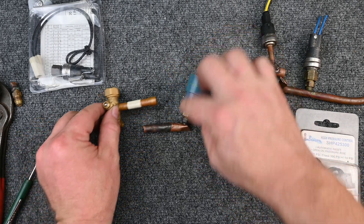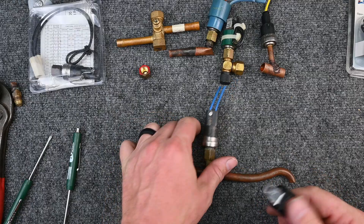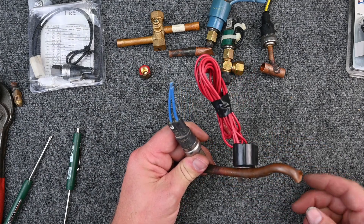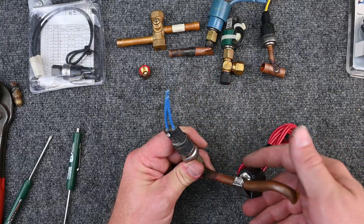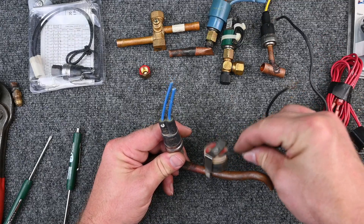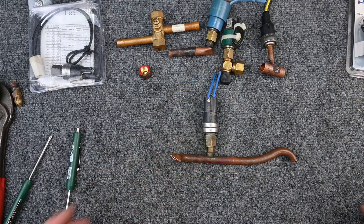Now, these are all a type of pressure switch, but don't confuse them with thermal devices. Here is a thermal device that simply clamps onto a line and checks temperature. These may still open and close at different temperatures, and some are thermistors that change resistance with temperature. When we get to electrical class we'll talk more about those. If it clamps onto the line, it's not a pressure switch — it's a thermal switch. Just a heads-up so you're not confused when you see them in the field.